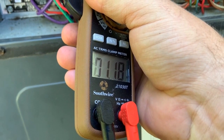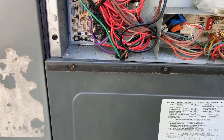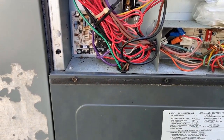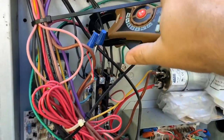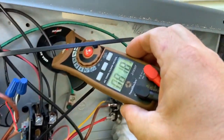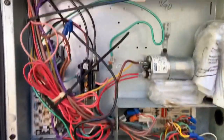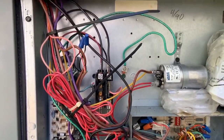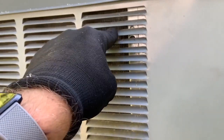We have 1.18 amps — let's see — 1.5, so we're good. Where's our compressor common at? I guess that's our blower right there. We're not doing too much investigation, so that's good. 7.94 total right there — 8.18. We know the compressor's not running too hot because our full-load amps is 14. Judging from the total minus what we've already measured, it's fine. We'll give it about 5 or 10 minutes and see where she's at on temperatures.